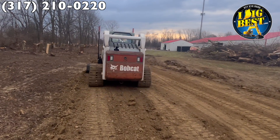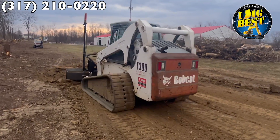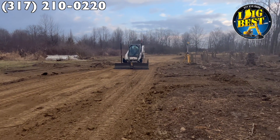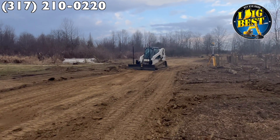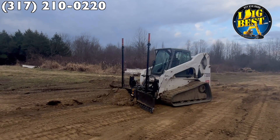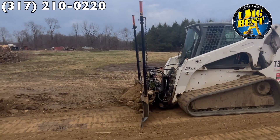It's like a human adjusting, but it adjusts so fast and is so stable. There are no counterweights — you'll see other guys putting counterweights on the back, putting wheels on — but this thing gets in here and you can V it forward or back, which you'll see at the end of the video. You can use it as a total dozer blade, and this laser setup makes it great for cutting pads, leveling arenas, roads — you can put a tilt on it, put a 3D model in, and cut all your curves, swales, and anything you want.